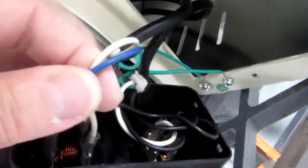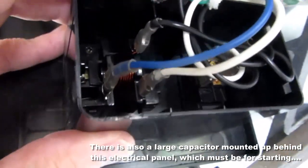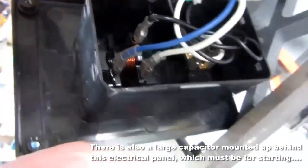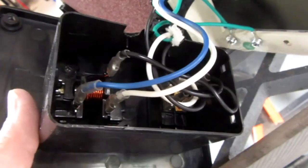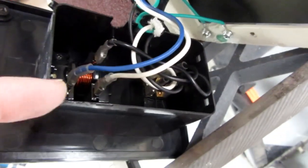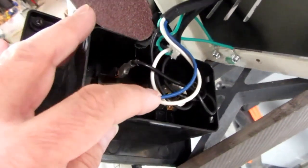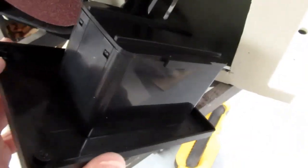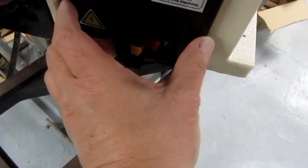The neutral side coming out of the switch is marked black and continues on to the motor. It has blue and white wires coming back, which I think has to do with starting the motor. I was trying to determine if there was any reason this couldn't be started externally using an external switch while leaving the built-in switch on all the time. But the way this is wired up, it might possibly not work well that way, so I'll probably just have to get used to using this switch.